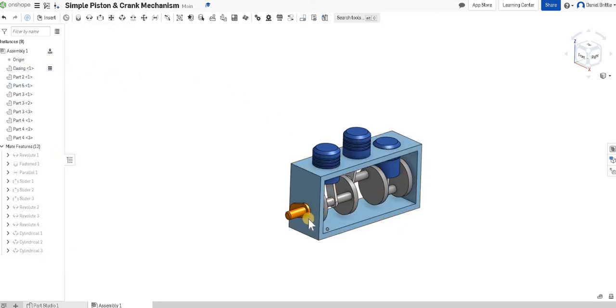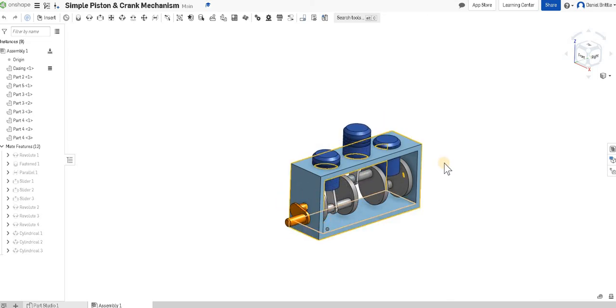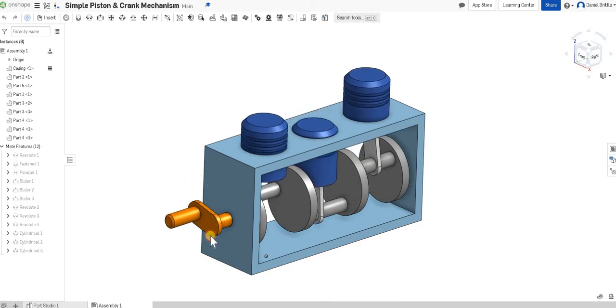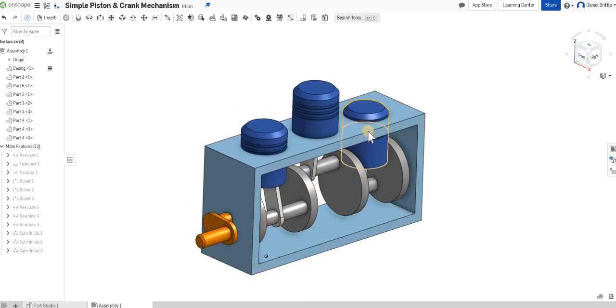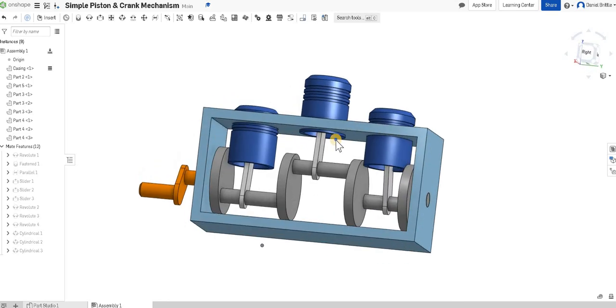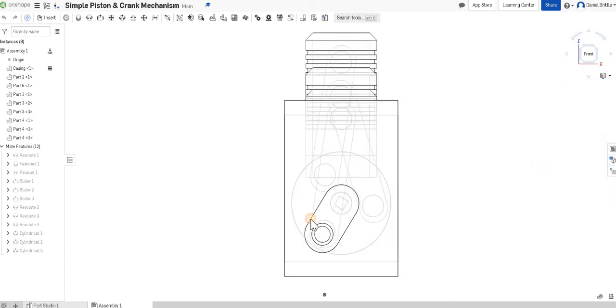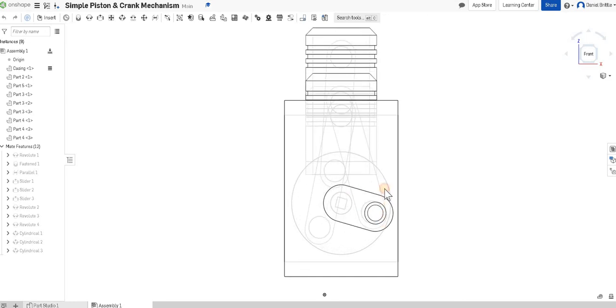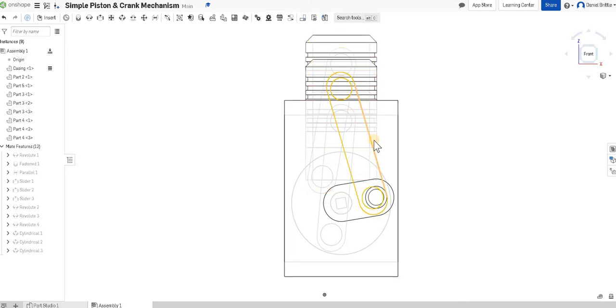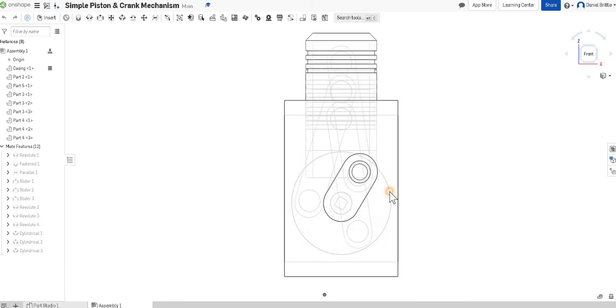Unhiding the casing — big moment of truth. As we rotate the handle round, we get all the pistons moving up and down. We've got our first assembly with an animation feature. This is great for testing: we can screenshot to confirm the pistons aren't going too low and aren't coming out of the casing at the highest point — dimensions are working. Looking at it with hidden edges visible and rotating around, you can see that one bar is cutting into the edge of the piston head quite severely, so we need to go and modify the piston head design to eliminate that collision.